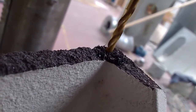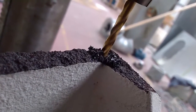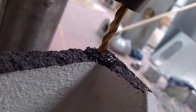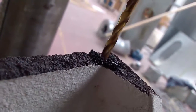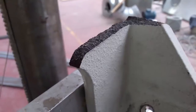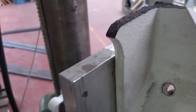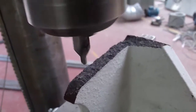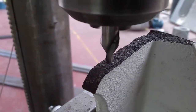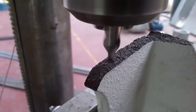Unfortunately, because I lost most of the video I had on this, it's going to be a very short video. I drilled all three holes, tapped them with an M4 tap, and put three screws in total. I started with a center drill just to make sure I got a nice hole started.